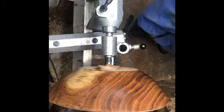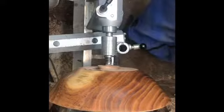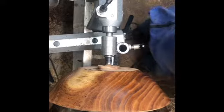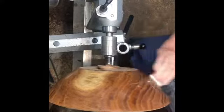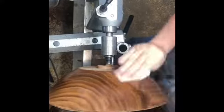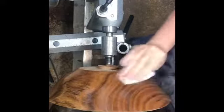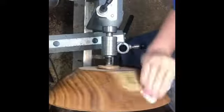I want to put on the polishing, that is the axe polish and restoring paste. Maybe you can see that. It's a white carnauba mixture paste. It's not just carnauba wax. I'm gonna start with that end grain there. It's got just a touch of mineral oil, some beeswax, and some carnauba wax. Carnauba is a nice hard wax, gives a good shine.